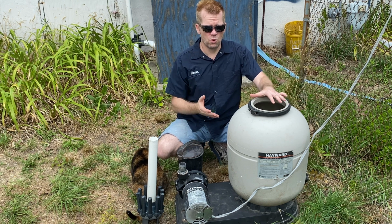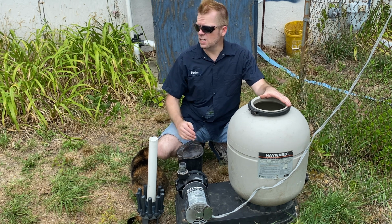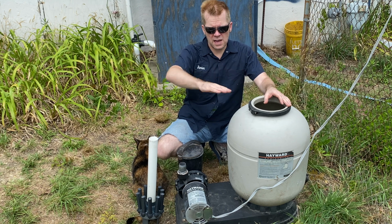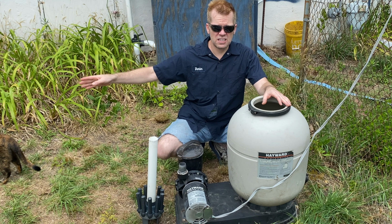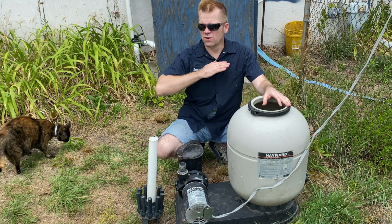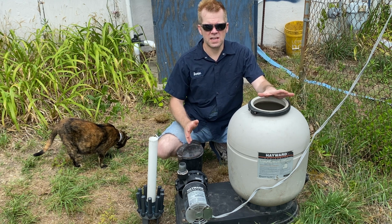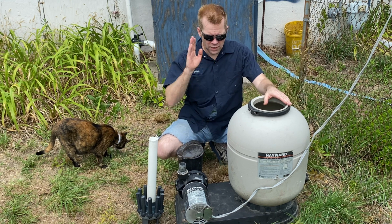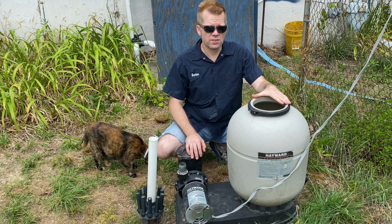I got 2 full 5-gallon buckets worth of sand, and we put that on the other side where we're going to start putting the paver stones. That way I can lay the sand flat, because if we just use the regular dirt, it's got rocks in it where I live here, and it'll never go out flat. So we have to get a little bit of sand or some kind of processed dirt, then roll out the mat and put the paver stone on. But I digress. So the next step is we're gonna have to wait for the medium.